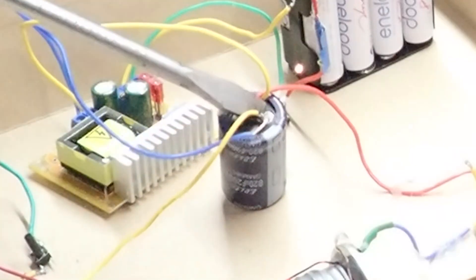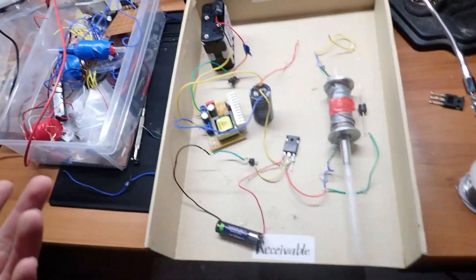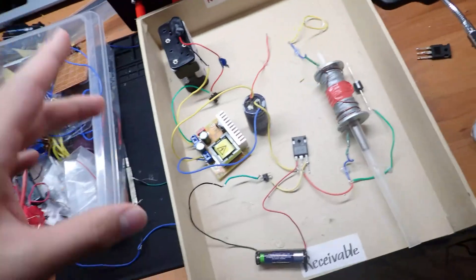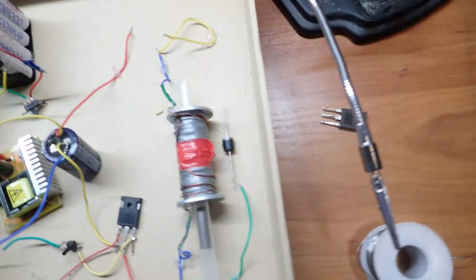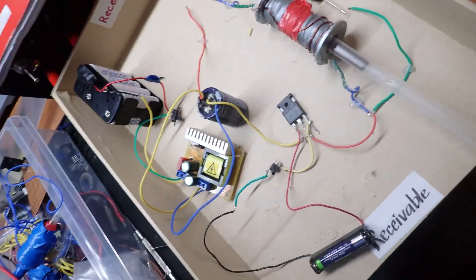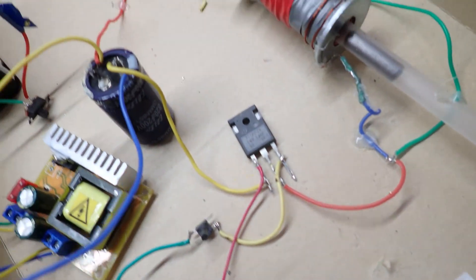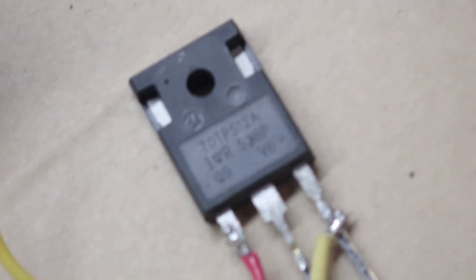So, what's going on? With this circuit I copied the Constantine guy exactly. There was some kind of short in the circuit — it was charging and it stayed at 25 volts. At first I thought it was the diode, I desoldered the diode, it didn't change anything. Then the suspicion was on the thyristor. I desoldered the capacitor from the coil and thyristor circuit, and then it charged up to 270 volts. Which means there is some kind of short circuit in this thing.